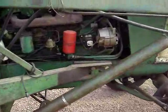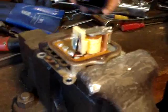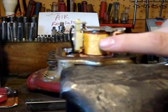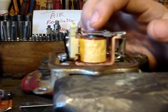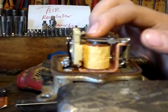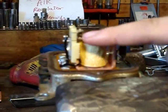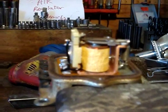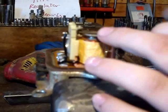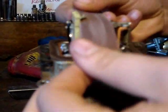So that's what she's doing, so we've got to pull our voltage regulator here. We just took out the two screws and took the cover off. If you look, this thing in the middle here is a piece of metal wrapped with wire — it's just like a little electric magnet — and all it does is pull this piece up and down so that it sends the right amount of current it needs to. There are little points down in here, just like the points in a points-and-condenser system on a small engine or an old tractor or vehicle. So we're just going to take some emery cloth, get it in between them, and sand them a little bit, then flip around and get the other side.